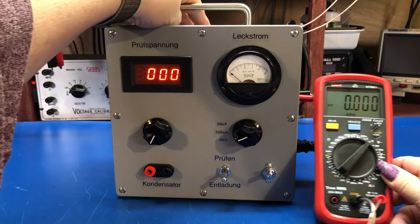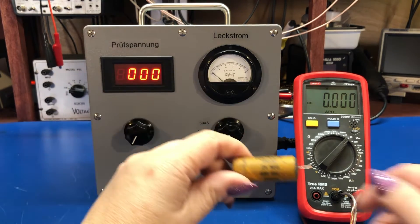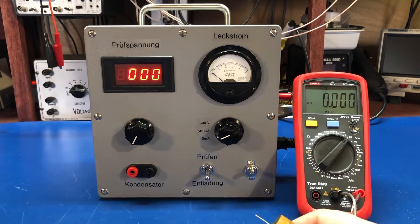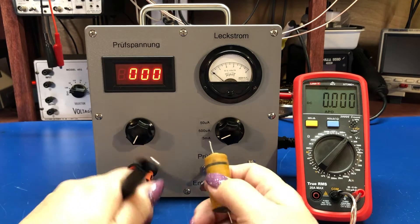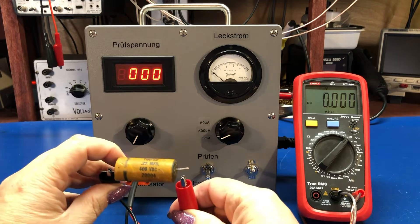This is not strictly needed — that's why it's got the meter in there. We're not looking for anything exact. What we really just want to do is see how the capacitor is behaving, if it's leaking. So let's go back to this cap here. This is a 0.25 microfarad, 400 volt capacitor. Let's put some test leads in there and hook it up.